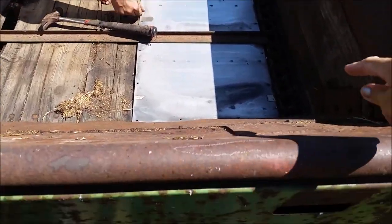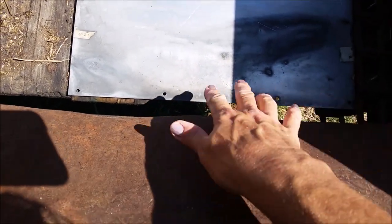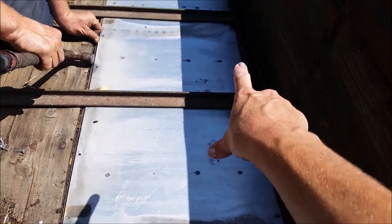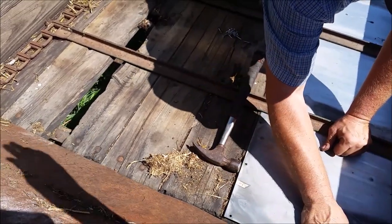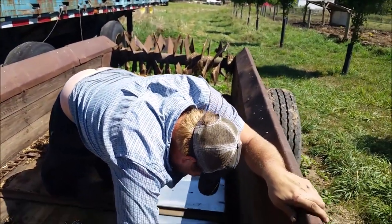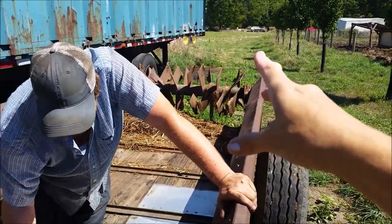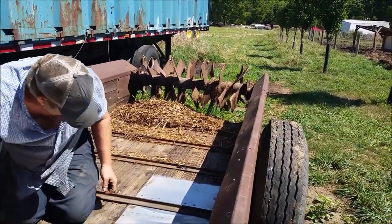So I have this section here with, you can see here, two boards missing to about that bar right there, and another section starting to go there. So it starts out like this, then the chain or the little unloaders get caught on it. This chain runs along the top and it slowly moves your manure pile to the back. Now, before we owned it, somebody modified this back flinger fingers, and it just really separates them, beats up the clumps, and gets them out of there.